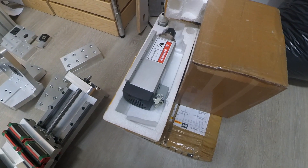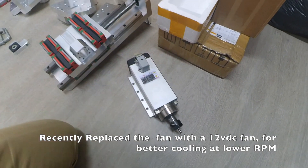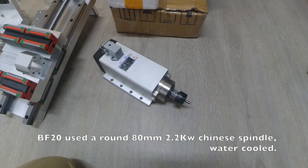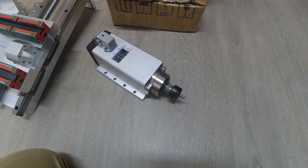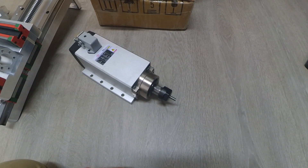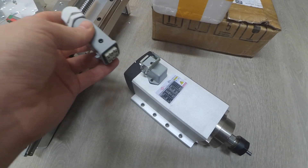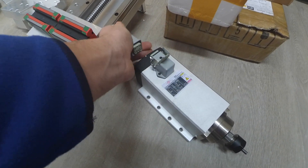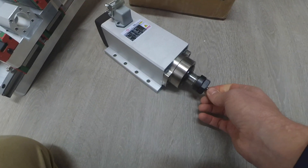The motor I'm using is this square air-cooled Chinese spindle using ceramic bearings. I was very pleased with the runout — the previous spindle on the BF20 was supposed to come with one hundredth of a millimeter runout but came with a few tenths, which was terrible. I also like the type of plug being used — it's much sturdier than the small XLR-type plug on water-cooled spindles. You just tighten it in like that — very neat, slides in and out easily.